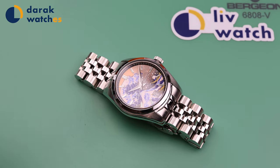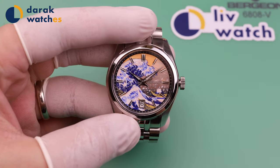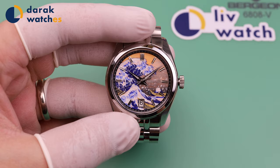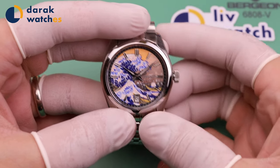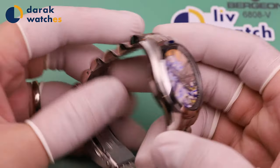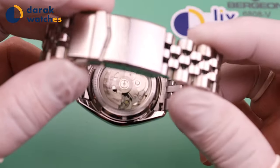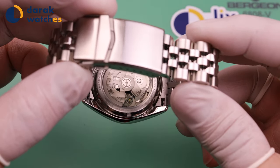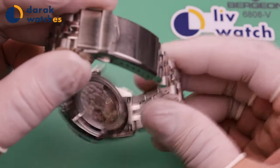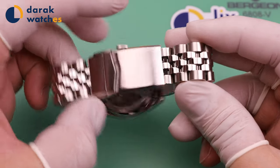This should be a two-part video. The first part is teaching how to mod a dial. And the second part is how to install a dial with dial dots. Installing a dial with dial dots is really not that uncommon or fragile. This is how we install a 3 o'clock crown position dial to a 4 o'clock crown position case or vice versa. After installation, the dial will continuously push against the movement and the case, so it's quite rigid.